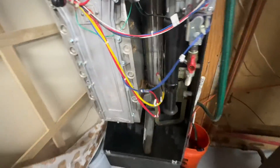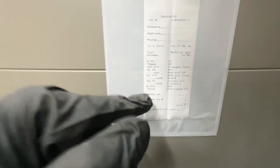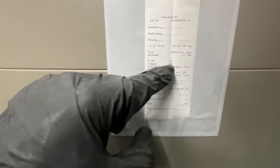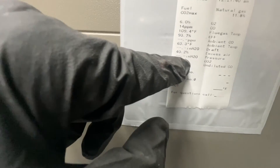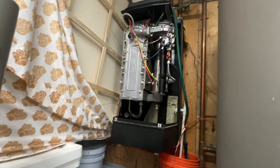But also from this being completely filled with water up to here — that leaves no flow for the exhaust. Everything's burning perfectly. Here's our combustion analysis. I forgot to save the high fire and low fire, so I just did one in auto, but I did confirm the high fire and low fire were good. You can see our parts per million on our carbon monoxide are within safe ranges, and we're still within that 1% for both high and low fire. This reading is good for both low and high — that's what tech support said.